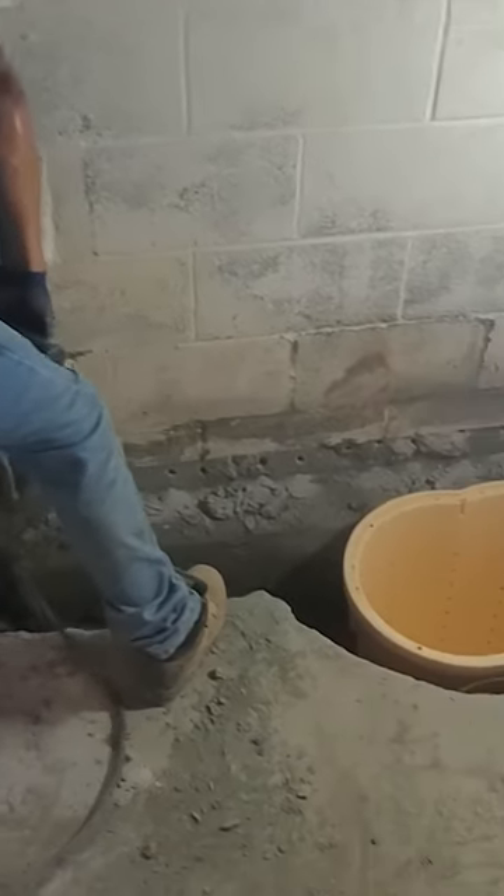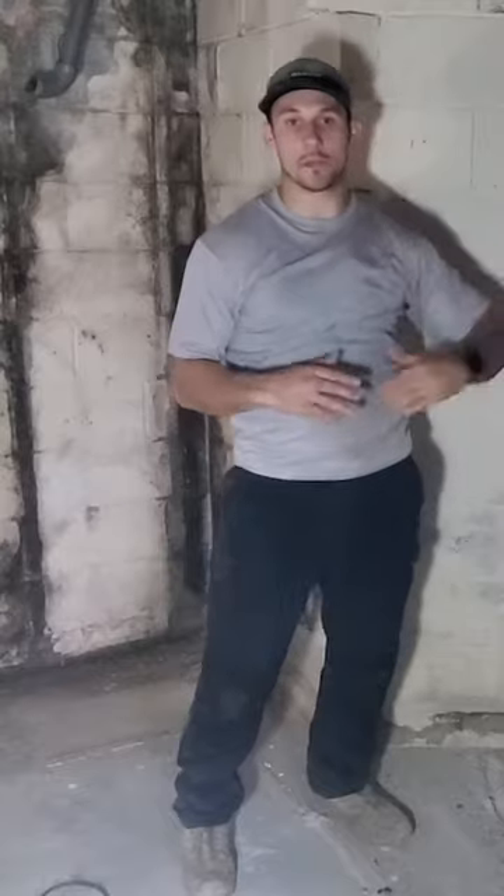Now this basin location here is because they didn't do any waterproofing on this part of the house, but if they ever needed to waterproof their basement in the future they were going to need to add a separate basin location because of the distance from here to where our basin is, and the way the pipe is pitched it wouldn't be very easy to attach the waterproofing system that we're doing right now into the new waterproofing system that might need to be done in the future.